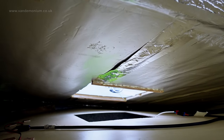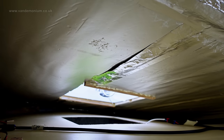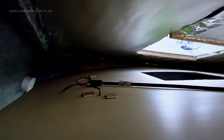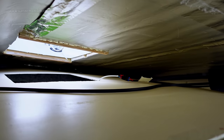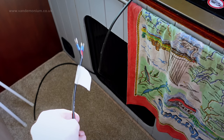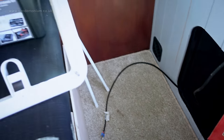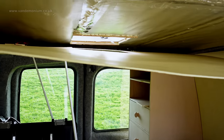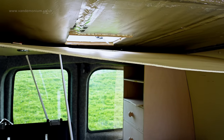First very tiny thing I notice is that that tape has come away from the insulation, thus breaching my vapour barrier very, very slightly. I've still got loads of the old tape, I'll redo that. However, what we can also see is wires there for the lights, and somewhere over there, wires there for the fan, so I can get to them. Well, well, look what we have here. We have front lights and rear lights wires detached. We've even got the frame of the fan detached and holding it up with poles, as you can see. So I can now have a go at rerouting the wires.